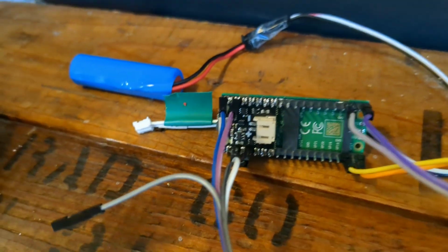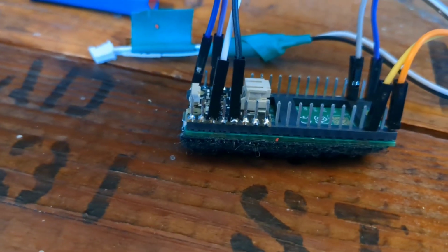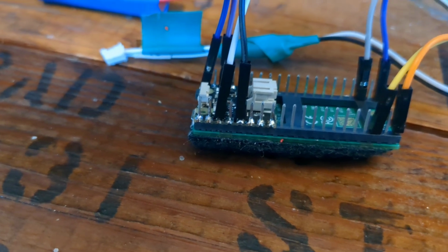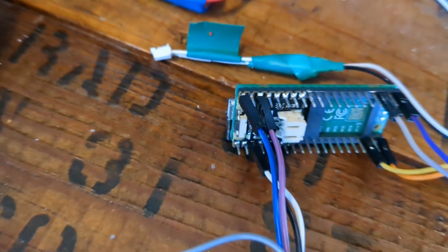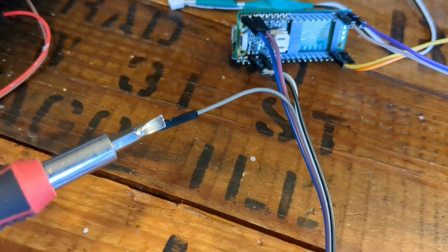And so over here on our Pi Pico, if we check the pins that we have it hooked into here, if you actually look at the pin out, this is just going to 3.3 volts and ground, so supplying power and ground. And then the other two here, the audio plus and audio minus, go to your first and third pins over on this side right here. Doesn't matter what order you hook those up in. A plus, A minus doesn't make any difference to this thing. And you can see here that this gray pin is not connected at all. So that shutdown pin over on this side gets no connect over here.